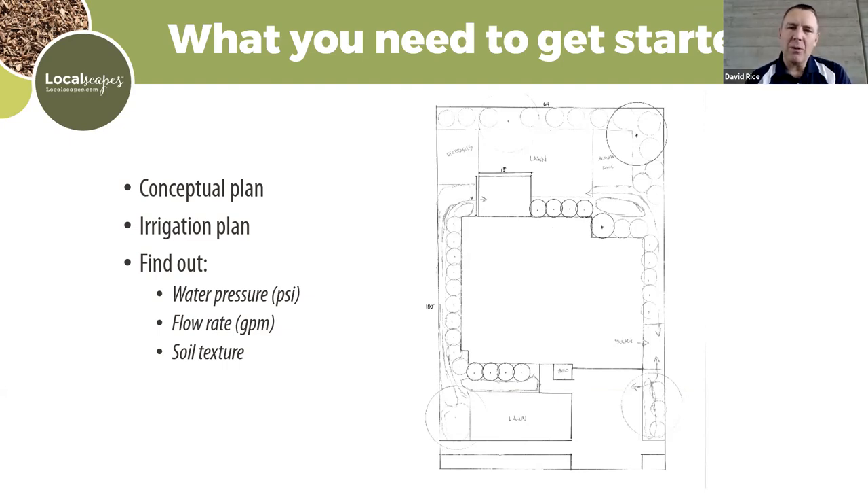Find out what your typical water pressure is — though pressures fluctuate all the time depending on time of day, usage, and elevation. If you're designing a new system, know what a minimum pressure will be so you get the appropriate number of sprinkler heads per zone. You should also know your flow rate — how many gallons per minute can go through your pipe and point of connection. These factors help you design, operate, and manage your system.